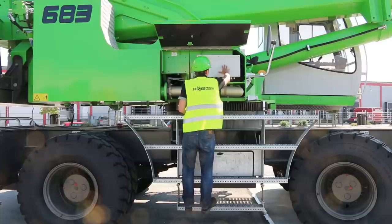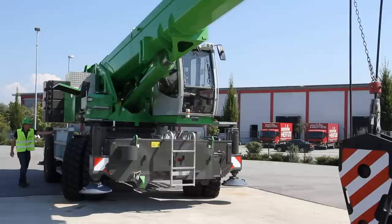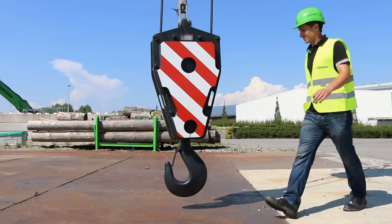The cover of the electrical cabinet should be checked for damage here. The external teeth of the slewing ring should have sufficient lubrication. These can be lubricated from the operator cab as needed. Now I close the side flap.